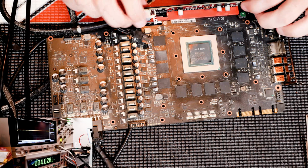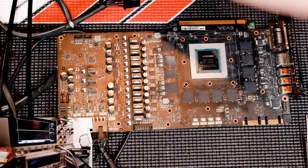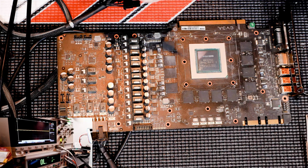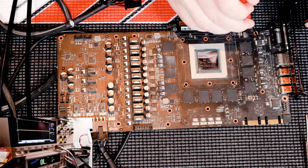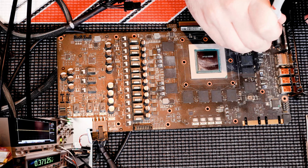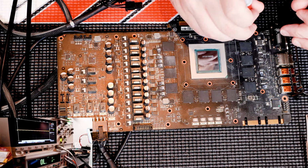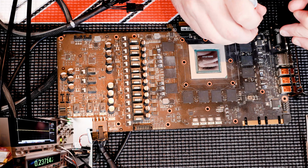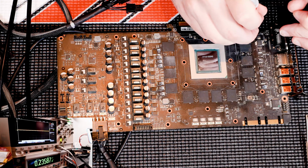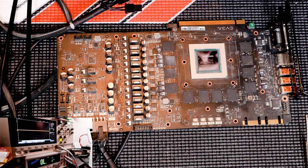Let's make sure that it's not the resistors that are bad or something like that. But yeah, okay. So here, 371 ohm. Yeah, that's right. And 236, yeah. 235, 236 is right. Yeah, okay, so the adjustment resistors are fine.